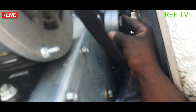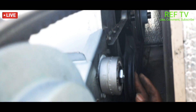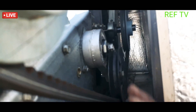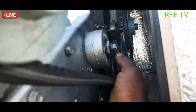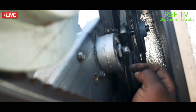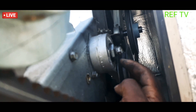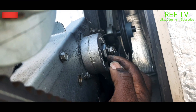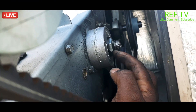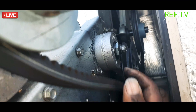We're gonna go back in there like this and then tighten this baby on, secure it up. I just installed the bolt, got this thing held up — it's not tightened yet. Before you tighten this bolt, you need to use an adjustable wrench on this little bolt right here to tighten the belt up and take the slack out.